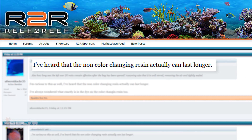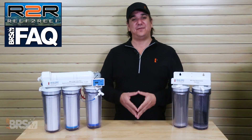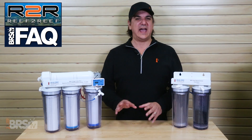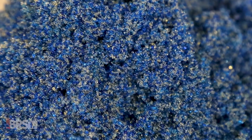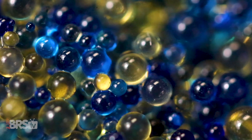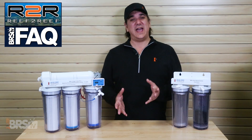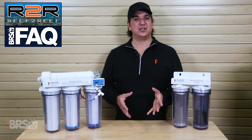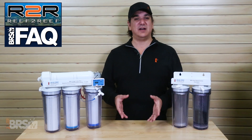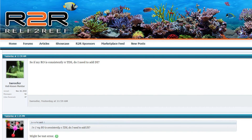Next, Silver and Black R35 asked whether the non-color-changing resin can actually last longer. I reached out to the lead chemist at our manufacturer and he said neither the cation nor the anion dye-ins reduce resin capacity. Although dyeing the resin does expose it to additional handling, in the case of the dyed anion resin it can increase the level of CO2 on the resin, thus lowering column capacity. So indirectly, with a bit of extra handling, there might be slightly less capacity — but likely not measurable or noticeable by the average user, and almost certainly not big enough to be the primary factor when choosing the right resin for your application.